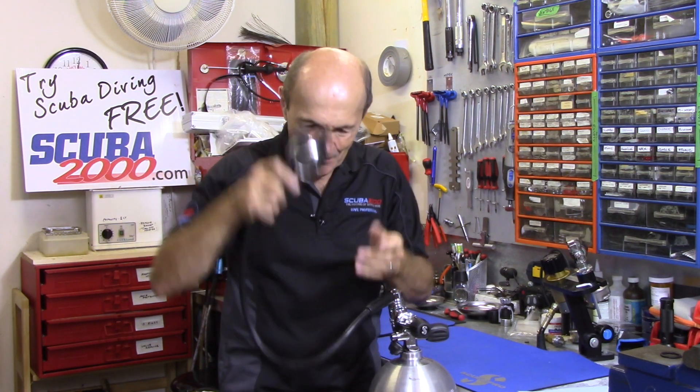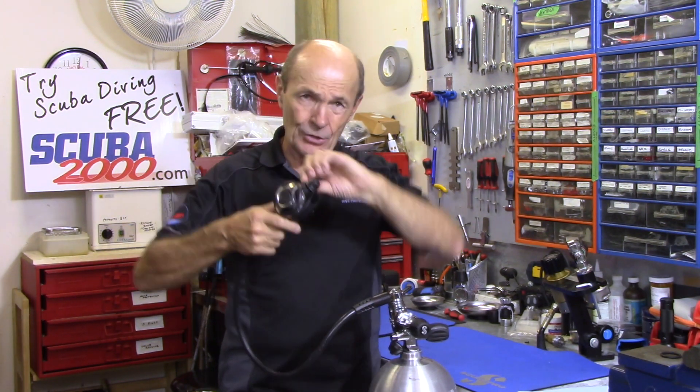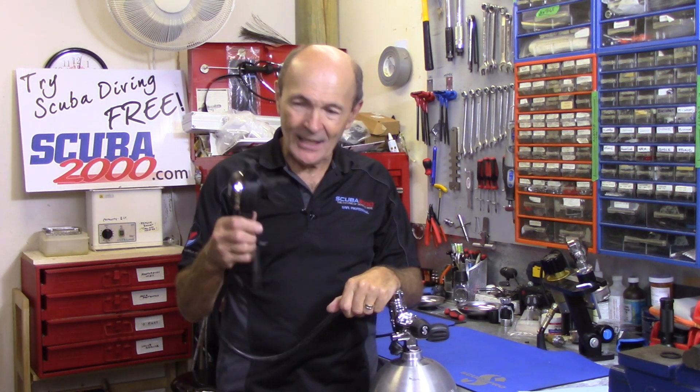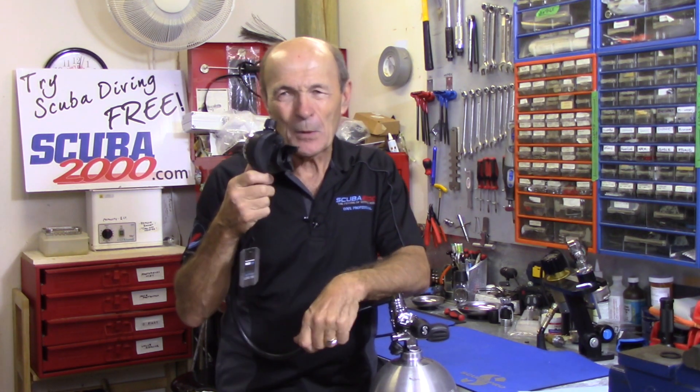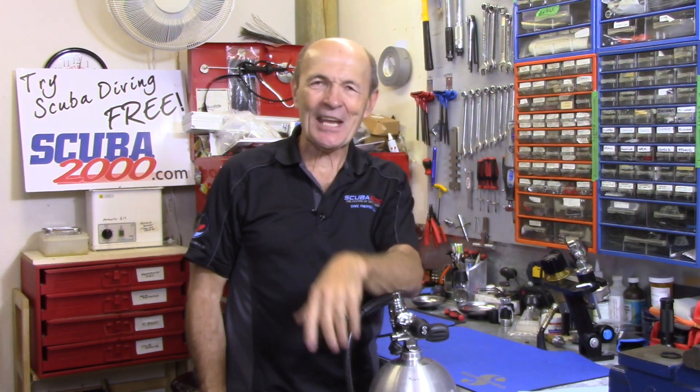What's the disadvantage of a Venturi? Well, how many times have you dropped your regulator in the water face down and air goes flying everywhere while everyone on the dive boat stares at you? The Venturi is on, it works, it sucks the diaphragm in and it free flows. Now you know how it works — it's not really a disadvantage if you understand it. You should not have the Venturi on unless you need it, and don't drop the regulator in the water mouthpiece down. There you go — Venturi: good or bad? You decide. Alec Pierce Scuba.